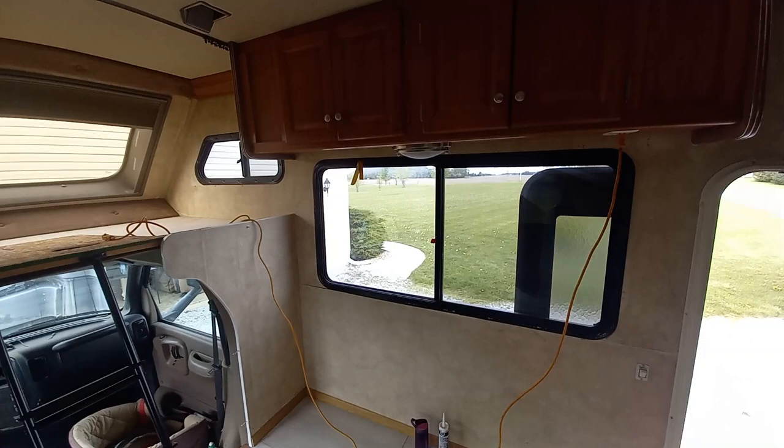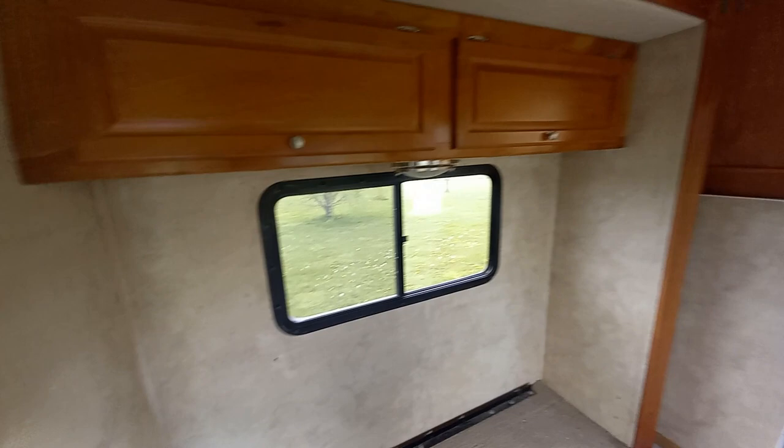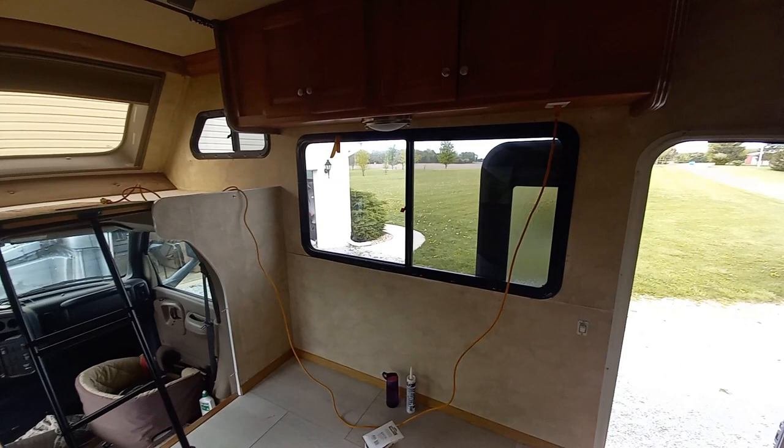All right, so I have this all sanded. I used the sander and a little sanding block. I've got this all done in all the small areas. Remember to take everything off the walls — take your plates off — and have everything ready. Now I've got a couple of spots that don't have tape; I'm going to have to figure something out because I couldn't find any locally. And then I'm going to start filling holes.